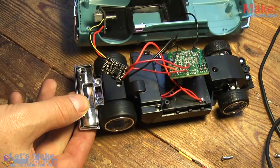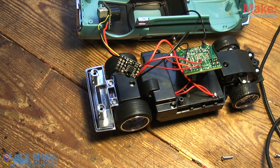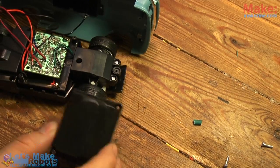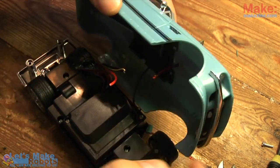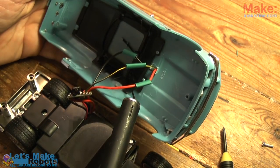Now that it could read distance, it was time to enable the microcontroller to actually control the car's driving. I placed the microcontroller in the circuit where I scraped the track earlier — out from the board chip into pin three on my microcontroller, so it could sense if I was pressing forward on the remote. Then out from pin two on my microcontroller straight to where the board used to get the signal, and now I could start and stop the car in the forward direction only. The car can still reverse if it's close to an object and the person is pressing the reverse button.